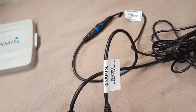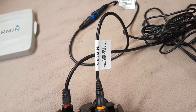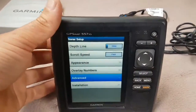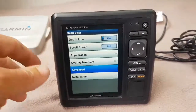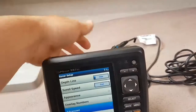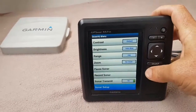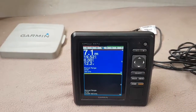Hope this was helpful. Garmin should actually make it more explanatory as to why you have to buy that cable — the main reason is the XID function. I have tried more modern 12-pin transducers on this unit which didn't work either, because they had features not built into this head unit. The 12-pin standard is more advanced than the 8-pin, which is why we're stuck with this adapter. But it works — finally it works! Thank you, cheers, bye!